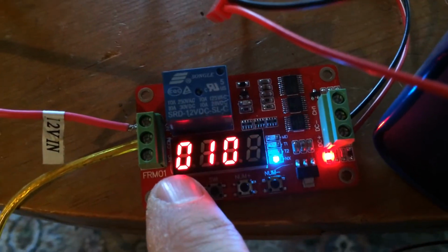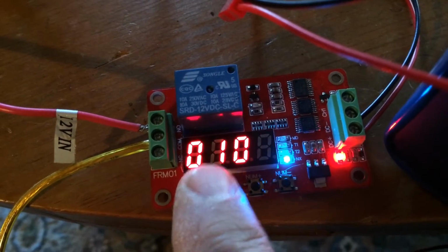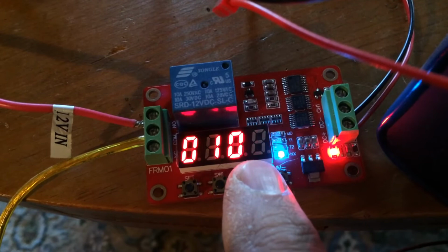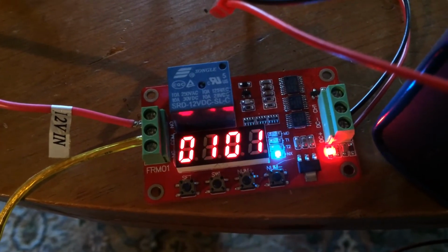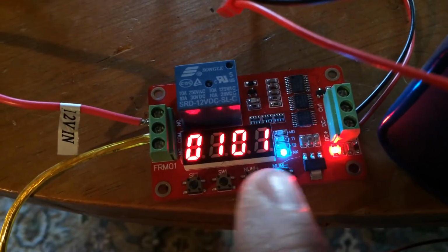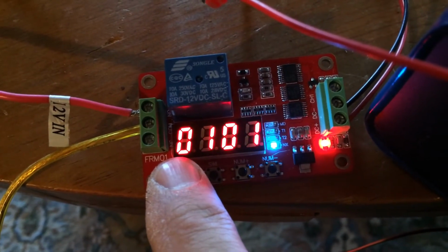And there's another parameter which is a multiplier. So if you don't want to use seconds, there are actually 2 parameters here. This is saying multiply each second by 1, and time 2 is multiplied by 1. If I made these 60 and 60, then instead of seconds it would be operating in minutes, for example. Or I could make these 2s, and then every tick would be not 1 second but 2 seconds. But we're just going to leave it at the default, so every tick is really 1 second, which is what we want. And then I'm going to have it start just by holding down that set button.